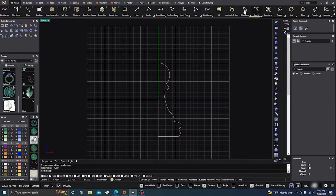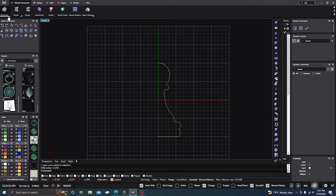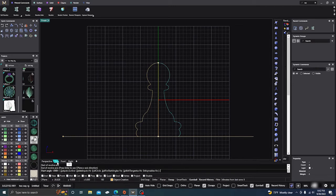From here it's easy. I'm not sure where Revolve is in the Surface menu — there are several revolve options — but I'm just going to type in 'revolve' and it should pop up. There's rail revolve, revolve, normal rail revolve, revolve SubD or clay, and others — we're just going to use regular Revolve. Select our curve, hit Enter. For the start of the revolve axis, click the bottom point, then for the end of the revolve axis, click the top.